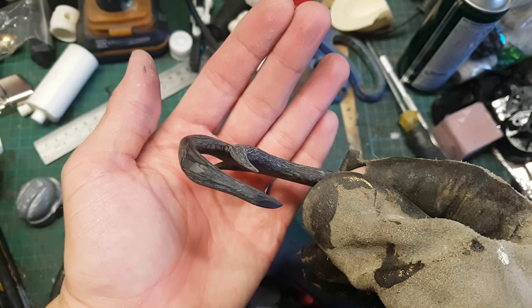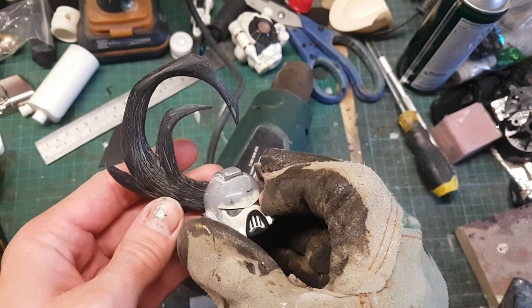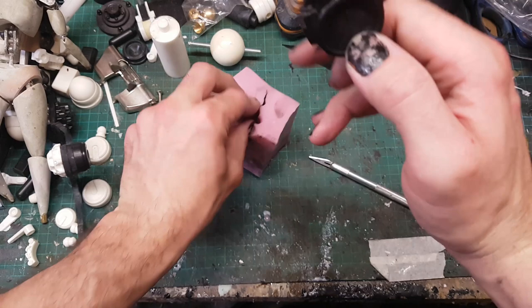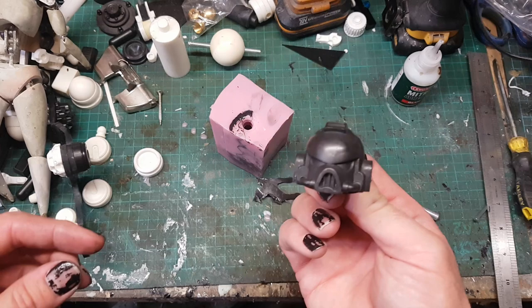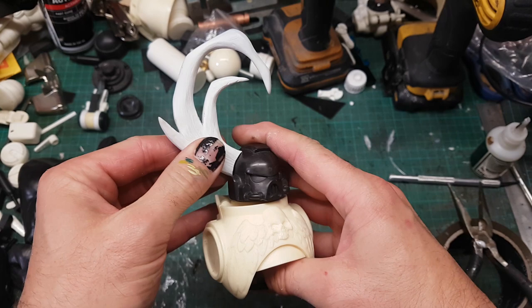Something else I made for the original sculpture was this Space Marine helmet. The original Marine had a bare head, but the helmet has been knocking about for a while and I never actually made a mould of it before. This time I've done that — I made a mould of this master and cast it up in black resin. This was an example of me using powder instead of pressure casting. I poured some graphite powder into the mould, and as you can see I can't see a single air bubble on this. Powdering the mould really does help.